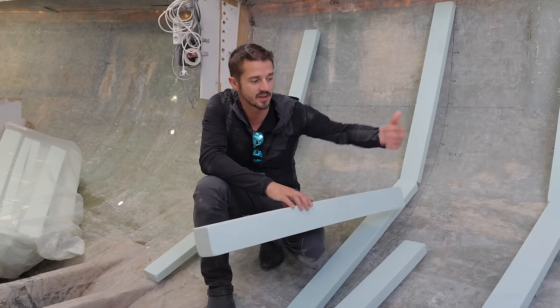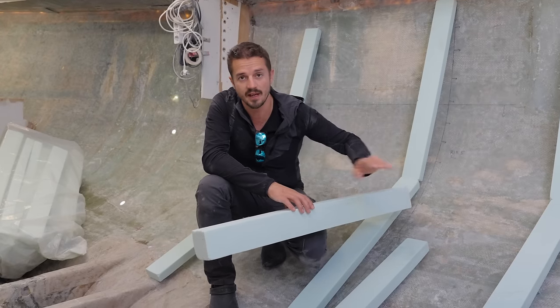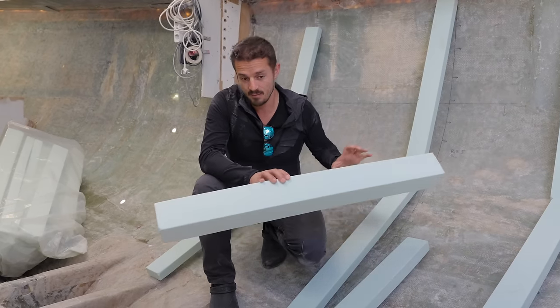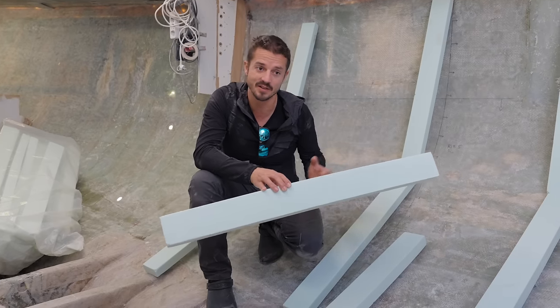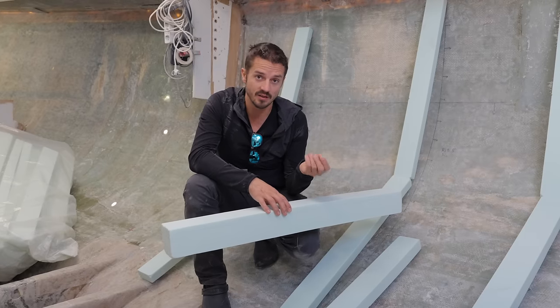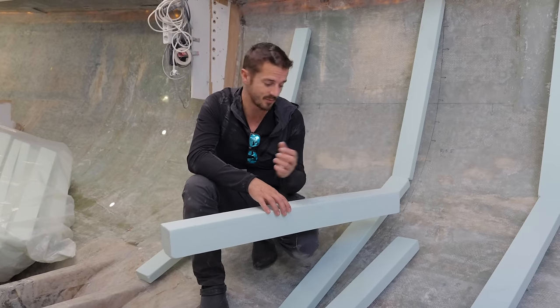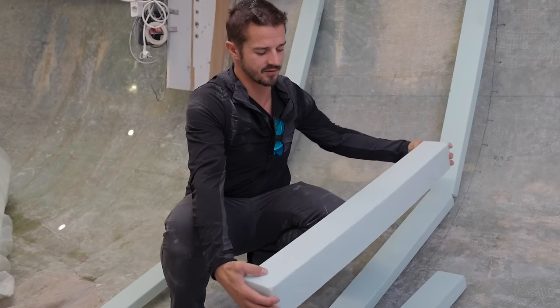the most sense, especially because we're gonna be splitting up the ribs as well, and all of the cabinetry and plywood that we're putting in is also gonna be glassed in. So we're sort of building two redundant systems, and they're both gonna complement each other to make a really strong hull that's still relatively flexible so nothing cracks and breaks. That's the plan. But even the 10 by 10 is relatively flexible.